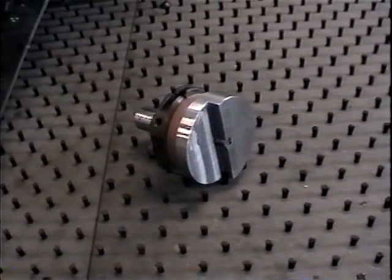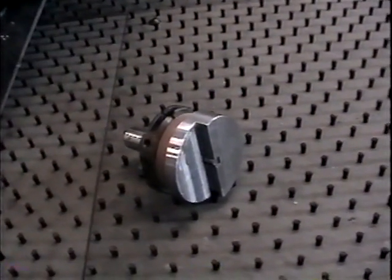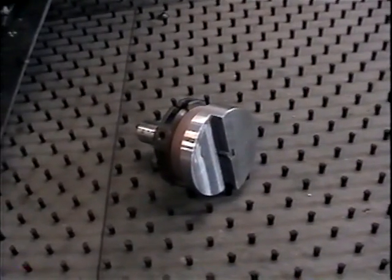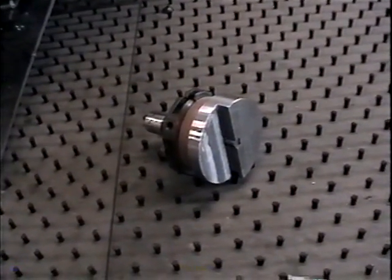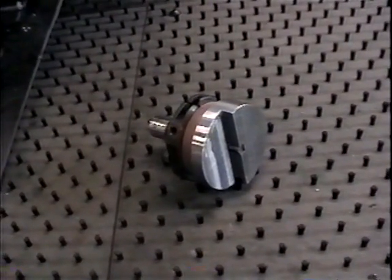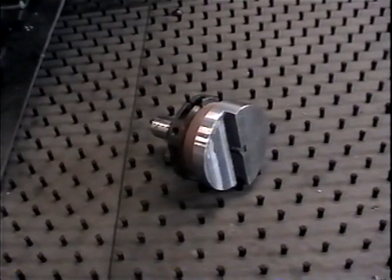This particular punch was designed so that we can rotate the ledge on the stripping plate at zero or 90 degrees. So you can really orient these hinges in the fixture either with the length of the hinge running in the Y axis or the length of the hinge running in the X axis, and you can change the tool accordingly in just a matter of moments to rotate the stripping plate on the end of the punch.